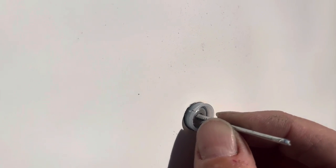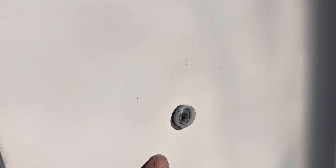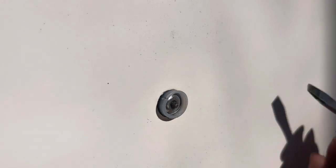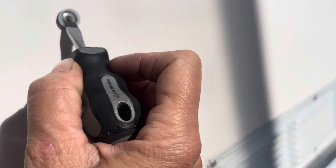Occasionally when you break off your rivet, the pin doesn't fully snap — it stays sticking out halfway and you can't squeeze it any further. In that case, I take a flathead screwdriver with a fairly sharp end, hold it at an angle against that piece, and then hit it with a hammer on the end to break off that little end.